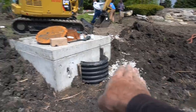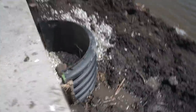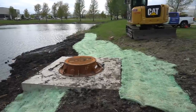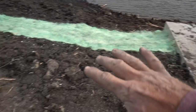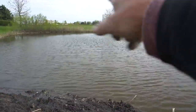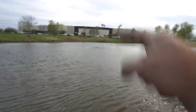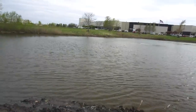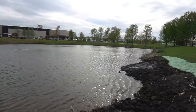The dam has been re-established. We're going to come in with a little more soil and put this culvert pipe here in front — this allows access for opening and closing the valve to allow water to enter for the pump for routine maintenance. Everything is completed — we've put down erosion blanket and seeded everything. We're dumping in water right here and it's coming right around to the intake, which is going to circulate this area and definitely help with overall dissolved oxygen. You can see a series of aerators out in the middle in the deep zones. Overall water quality is really good here — they do a great job managing the watershed, have buffer zones around the perimeter, and stock it regularly with fish.